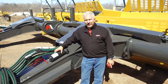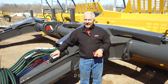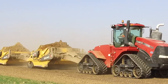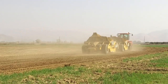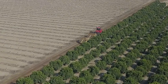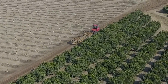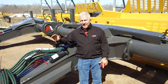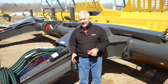At the front of the scraper we have our ride control system — a 2.11 gallon hydraulic accumulator tied to the hydraulic lift cylinders at the rod end oil, preset at 2900 psi. Any pressure above 2900 psi — say you're going down a haul road with a fully loaded scraper and you hit a sinkhole — it allows that pressure to dump oil into the accumulator. Once it goes below 2900 psi, it puts the oil back into the lift cylinder. Some competitors have a smaller accumulator that acts as a pressure relief valve, but it dumps back into the tractor drain. On a rough haul road, you keep losing that oil, meaning the blade could actually hit the ground. Our system is self-contained — it allows you to relax without worrying about the blade diving on the haul road.